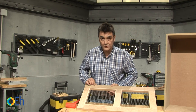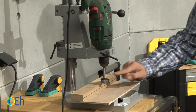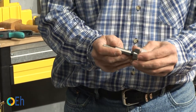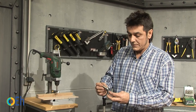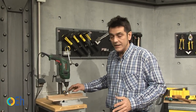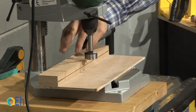What are we going to drill with? With this tool — it is a drill guide support. We also need a Forstner bit for the drill. We are always going to keep them well protected. Its configuration allows you to perform very well all the hollowing out of the wood. The important thing is that you adjust the bracket well, for example by using a piece of board or by measuring carefully. That's how you will get a good depth, and you will not go through to the other side. Here I have marked 11mm deep.